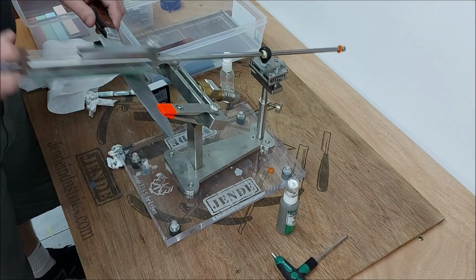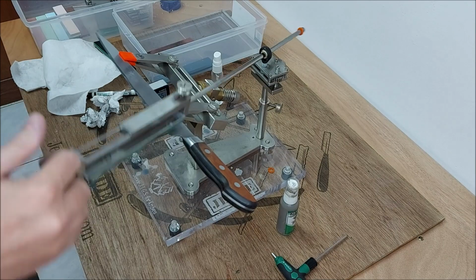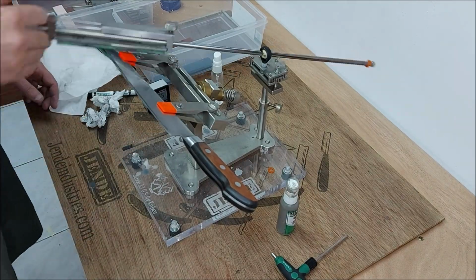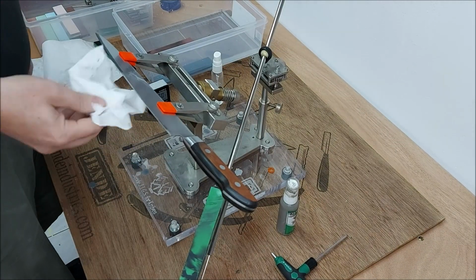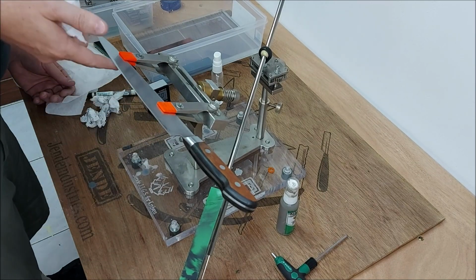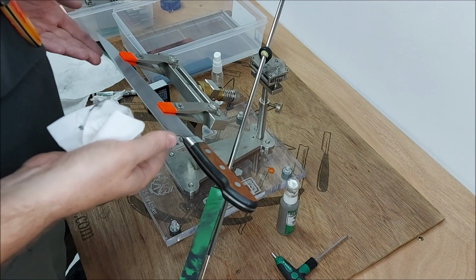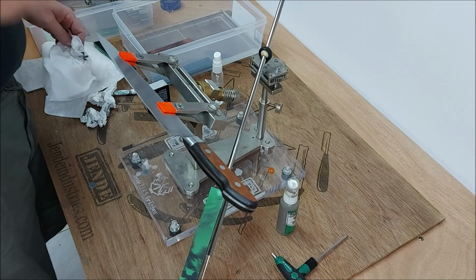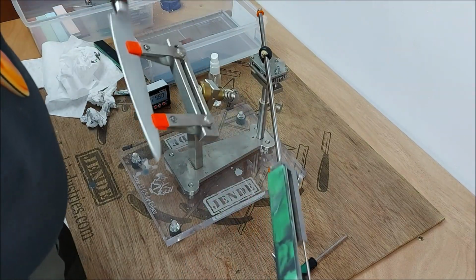Troubleshooting is the key to sharpening. I've got a very solid line at the edge. So I don't see any remnants of the 13 degree, the 14 degree. I think I've removed most of that just because of the sheer aggression and the angle change. It's just going to eat into that edge. It's so thin, you're just going to go and establish a new geometry. So it happens pretty quick. Just give it a few passes here to even everything out.